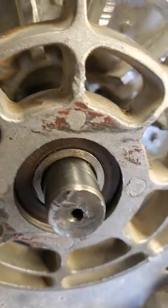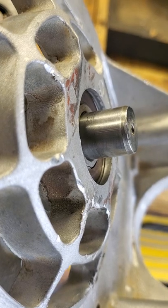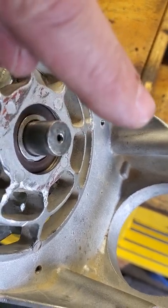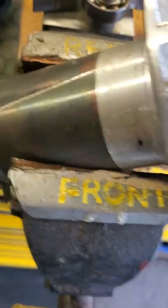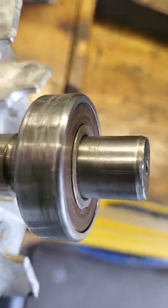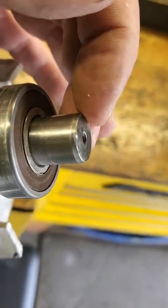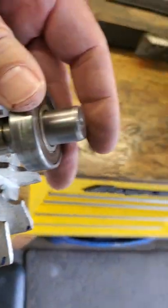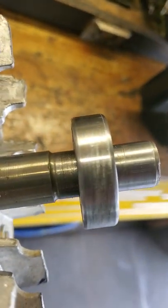So if you wanted to use this motor, all you have to attach onto is just a half inch of shaft somewhere in the 17-millimeter range, which would be useless. You could think about welding on, or you could chuck this rotor into the lathe, turn it back down to a standard size like five-eighths of an inch — but you would never trust it. There's no way you would trust that. The bearing's kind of tight too from my pounding on it, but that's how they built this thing. Very, very tricky — that's why I had problems disassembling it.